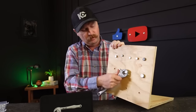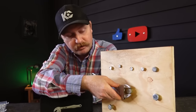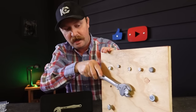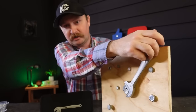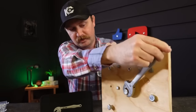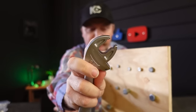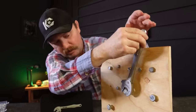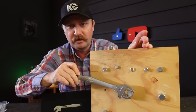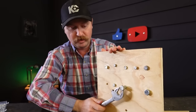When you put the three-quarter wrench on it, it's very close to the full size of the wrench. To show how these work: the head rotates and you just pop it on like that. You put the top of the wrench head there, rotate it down with your hand, and then you can use this like an adjustable wrench. Once locked in, turn it, and it will auto-set going back the other way so you can continue to turn without ever removing the wrench from the fastener. They also have a little jaw with hooks in the front that will actually snap onto the points of a bolt head.